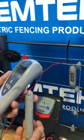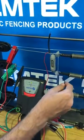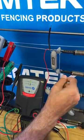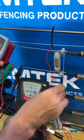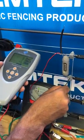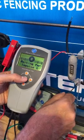I'm going to introduce a small fault for demonstration purposes. I'll put the thousand ohm load that comes in the kit to demonstrate a fault on your fence. I've just put it onto the earth wire over here. Now with a fault of a thousand ohms, we should see an increase in our current — waiting for the impulse.